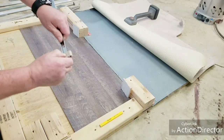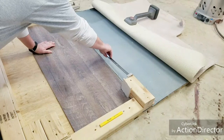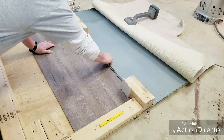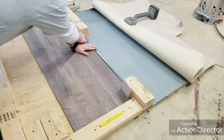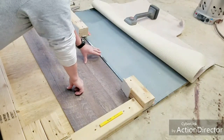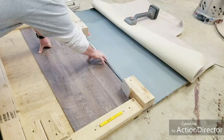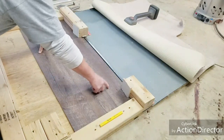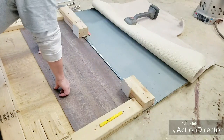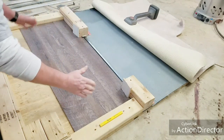And what that does for me is it allows me to double check all my spacing. So when I drop it in, I can see that it will cover. I know where I can put my carpet, even to the point before I have the floor completely installed. A lot of times we can put this in with the spacers, and I know exactly what size to cut this last plank that goes under the door casings.